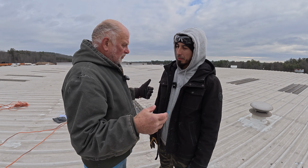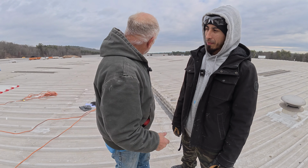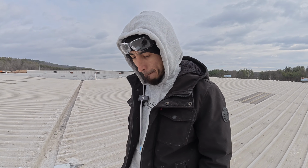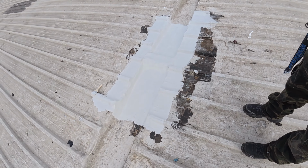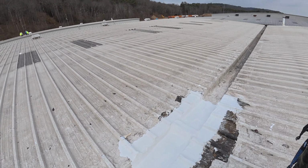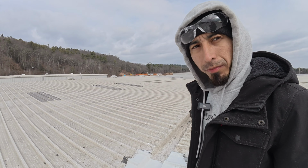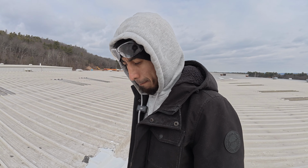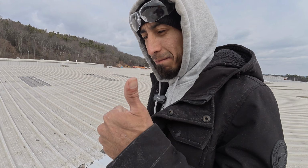So I already located the leaks inside. Now we see on the outside where it's leaking, next to the skylight and in the gutter here, right? Okay, we're going to start working. The test: you know what to do. You know what products to use. In this case, you use super silicone seal. But now we're going to do another patch. Let's go over there so you can do that one patch with your final test. And then I'll give you the stamp of approval.